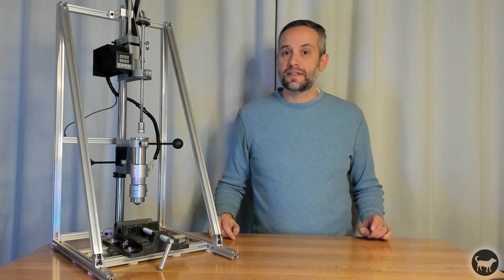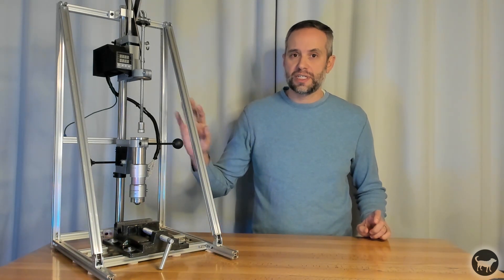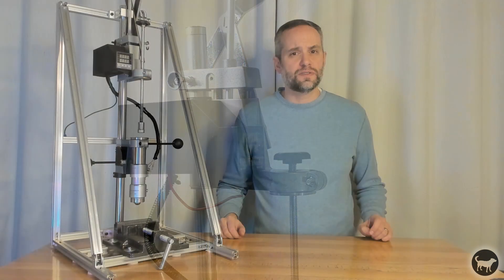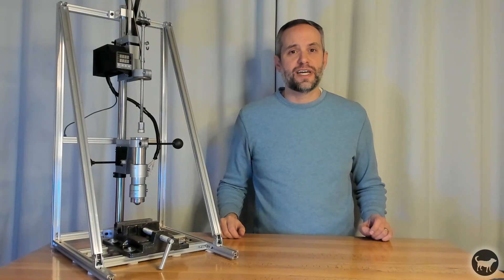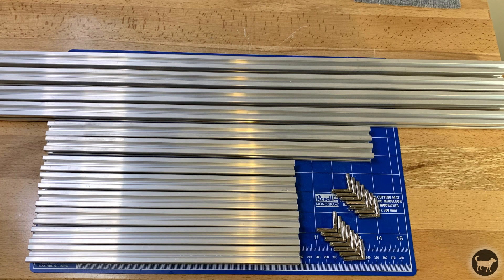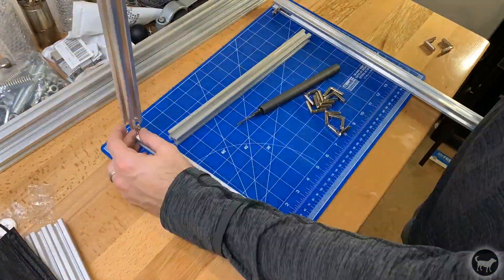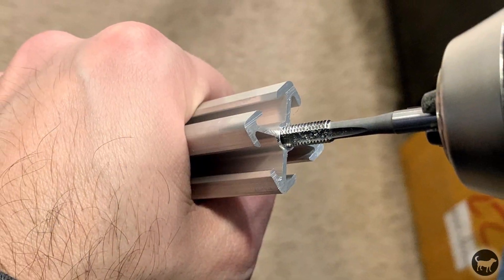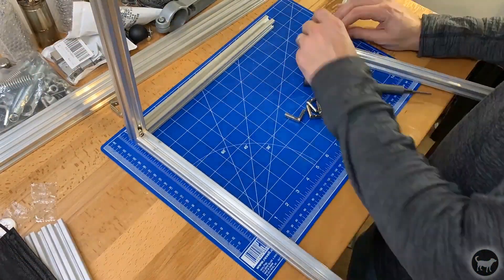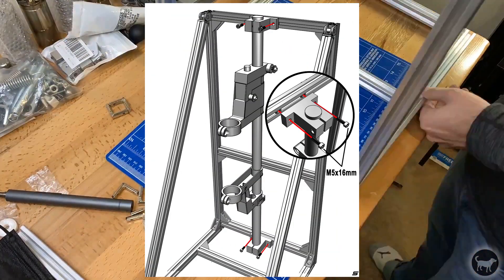Because of the added length of the chamber and the screw, it was also necessary to increase the height of the original machine. I had first attempted to simply extend the pole and use the same base, but it truly felt dangerous and caused the pole to flex when pulling down on the handle. I felt the best thing to do was to build a frame of 2020 T-slot aluminum extrusion. I purchased all of these sections cut to size and just had to put it together. I did have to add an M5 thread to the center hole of the angle support braces, but the rest just bolted together. I have created a PDF that goes over how all of this goes together, and you can find a link to that in the description.